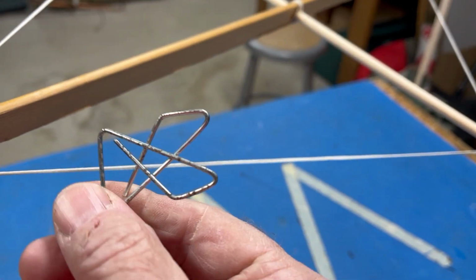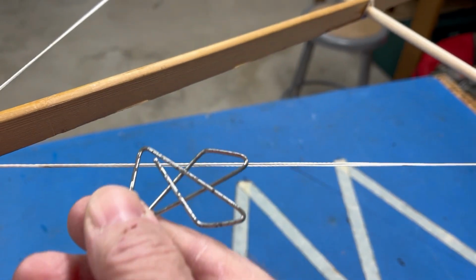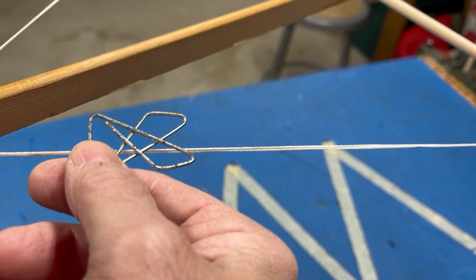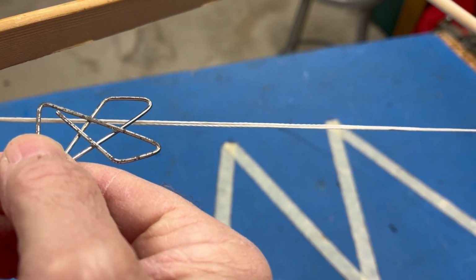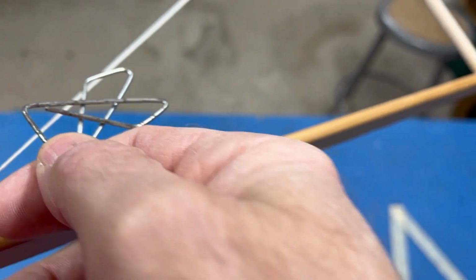So when you have a wire like that, the lobes start to shoot off the sides like this. Excuse me. They're not like a dipole. They get closer to the end of the wire, if you will. And so now you have a lobe. If I put this right on here, you have a lobe pointing forward and a lobe pointing off to this side here. And that lobe is canceled with the other ones, but the ones that are inside are additive. So you have a lobe here, the same kind of lobes over here, same over here, and the same over here. Boy, I'm really terrible at this.